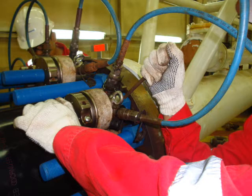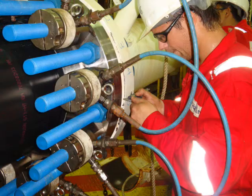the nut can be run down to make contact with the flange face. The pressure is released from the hydraulic jacks and the load is retained in the bolt by the nut being hard up against the flange face. Vernier gauge readings are taken at the cardinal points of the flange faces to prove even spacing of the flange faces all round.